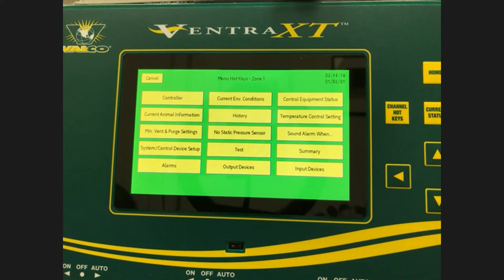How to change parameter sets: you still need to cycle power to the controller, because it's during the boot-loading process that it can say 'I'm going to look at the SD card and pick a different parameter set.' When you cycle power, everything's on screen — no magic button combination. The first thing it says is 'do you want to do this?' and you press enter on screen or on the side, and you can change parameters. Next question: do the ammonia or CO2 sensors affect ventilation? Right now they do not — right now you can set an alarm for each of them, so it's for historical logging and alarming to see if you're getting above a certain threshold, but at present it's not changing the ventilation scheme based on what it reads.